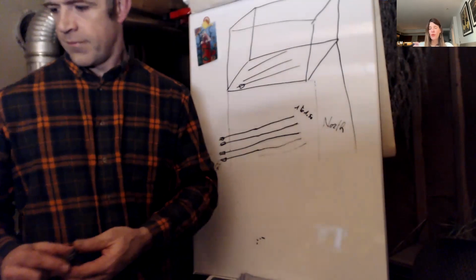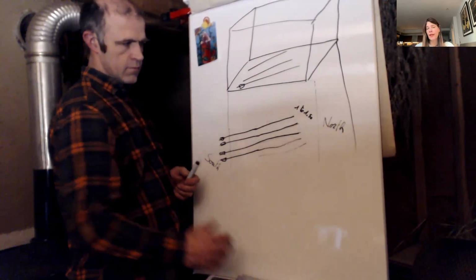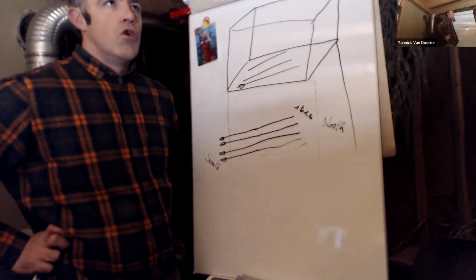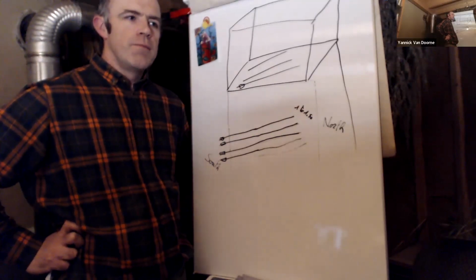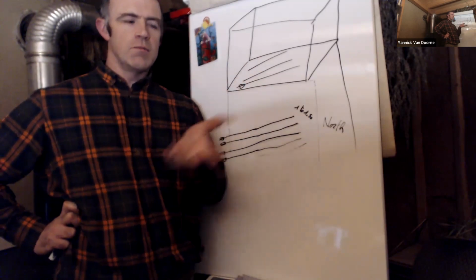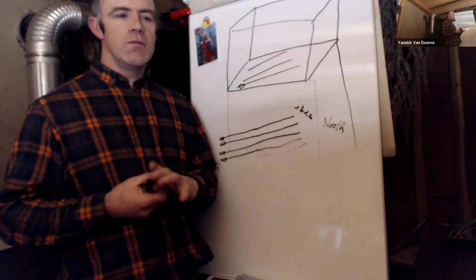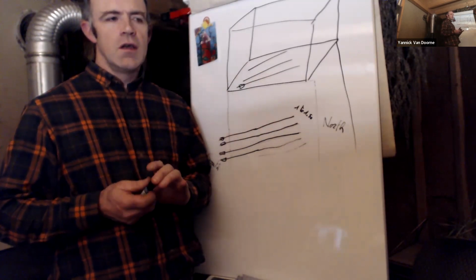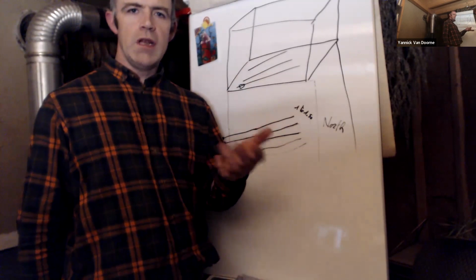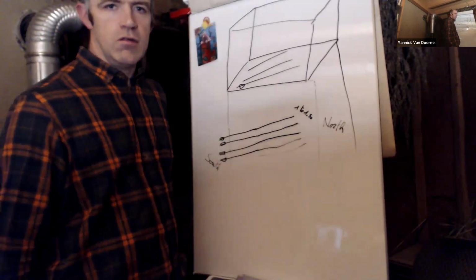A few more questions. First, on the steel wires themselves, do you need to treat those wires for any kind of anti-rust or any kind of protection before you install them? No, not really. The thicker the wire, the longer it will last. But in the concrete, it's already protected by the concrete, so it will rust a little bit, but not much. It will not really be a problem. So if you put like 2 to 3 square millimeter wire, it will hold maybe 1,500 years in your concrete.